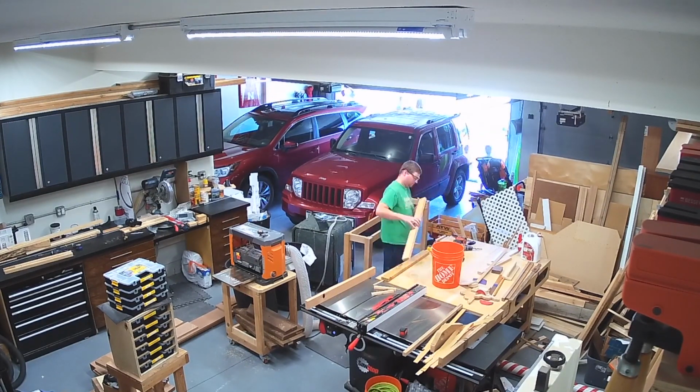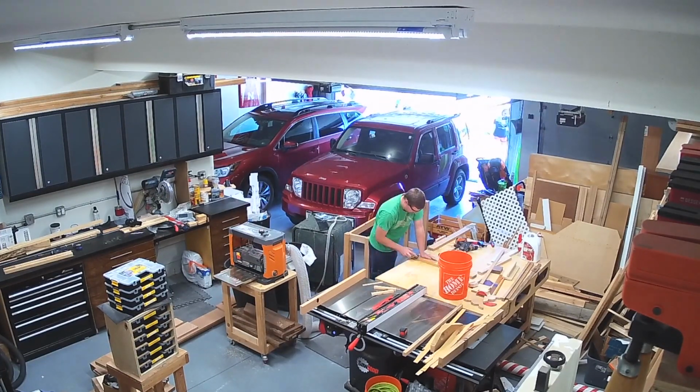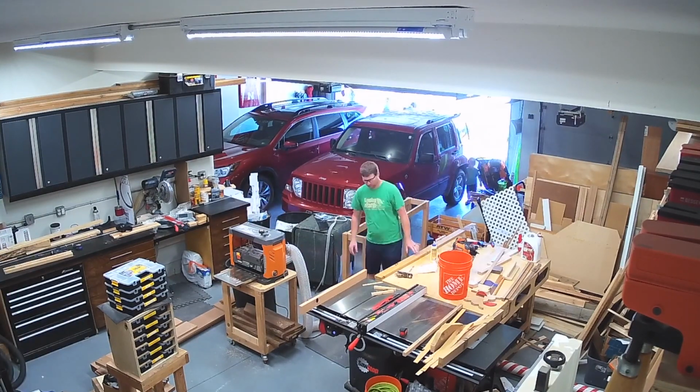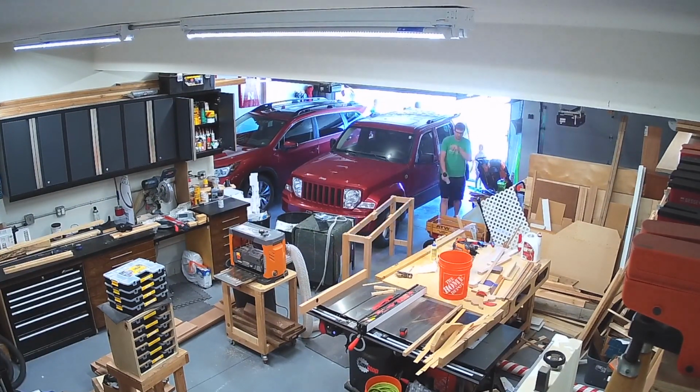I had put the legs together a few weeks ago. I laminated 2 pieces together to make legs that ended up a little under 2 1/4 inches thick and 3 inches wide, and used the same dowel assembly for the short stretchers between them.